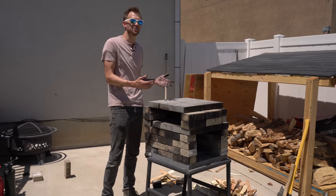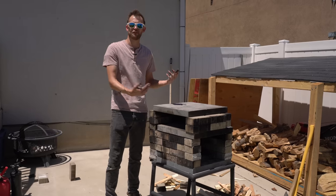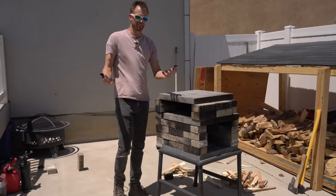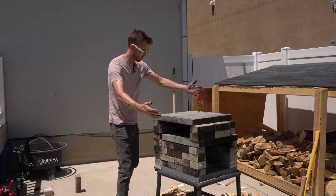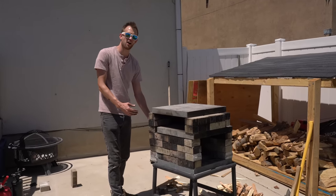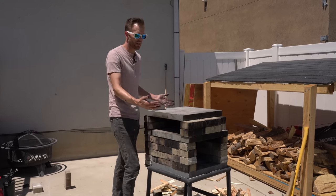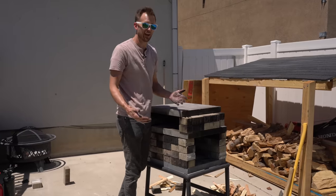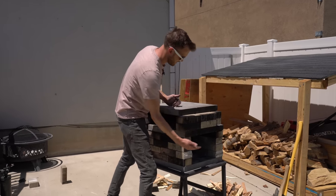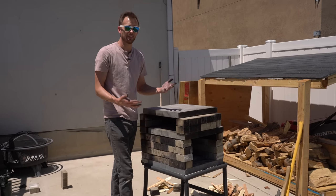The first thing to share is that originally I had some wind coming in and I thought, well, point the fire away from the wind. But what seemed to happen is the moving air going around the box was creating negative pressure and pulling all of the hot air out where the fire is supposed to be going in. So I've turned that around and it seems to work a lot better now — I've got the wind coming in this direction so some of that air is going to blow in and help it flow through, instead of sucking it out the back and lowering the heat temperature.